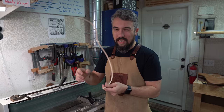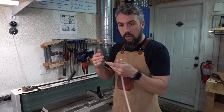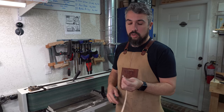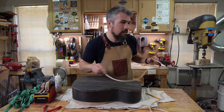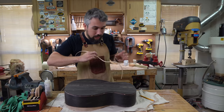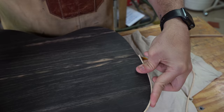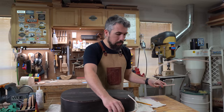I used to spend so much time with my chisel trying to get that cut right, and I'd end up with chip-outs. When I got this edge sander, trimming binding joints was one of the first things I used it for. You can do 45-degree angles and all kinds of fine miters. If you have an edge sander or a stationary belt sander, think about using it this way — it makes your life so much easier. Now we have a piece of binding that fits in here super nice and lines up dead perfect.